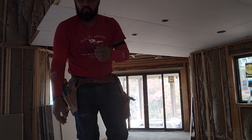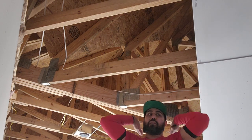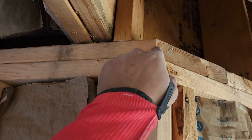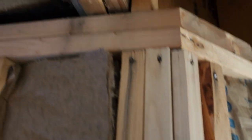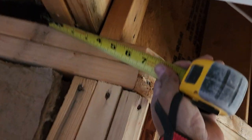The video's really dark. We're going to be on this side here. We're going this way to get my cut in here. There are two different ways to get it. I can just measure from here to this point, and then from here — let's say I'm going to go with four and three-quarters right there, and then six and a half. So I mark four and three-quarters, six and a half, and whatever is left from here I give it to that side.